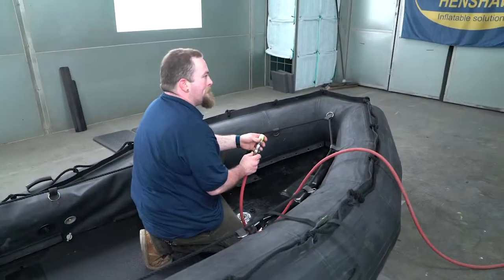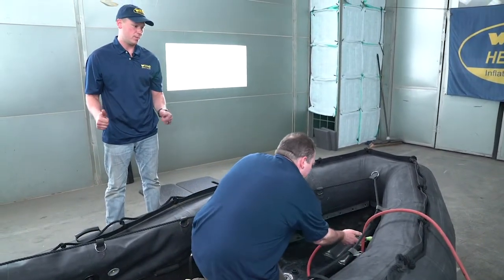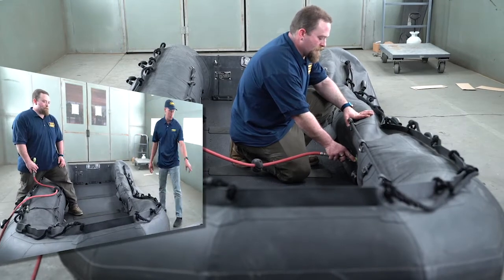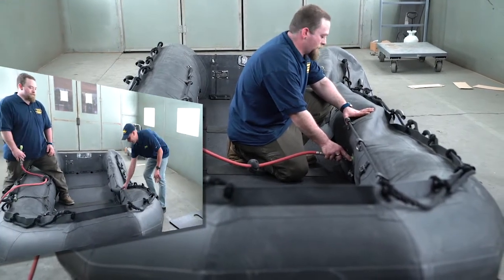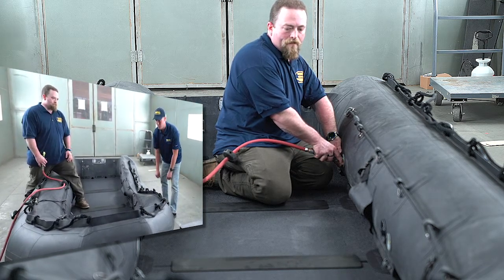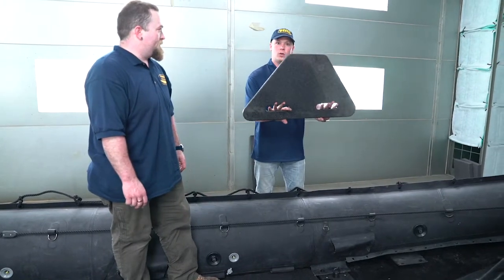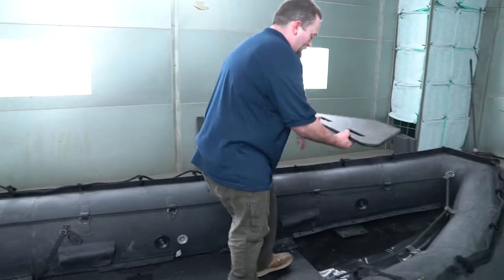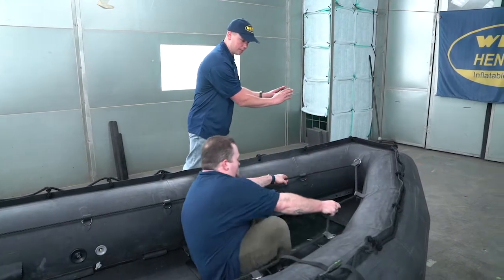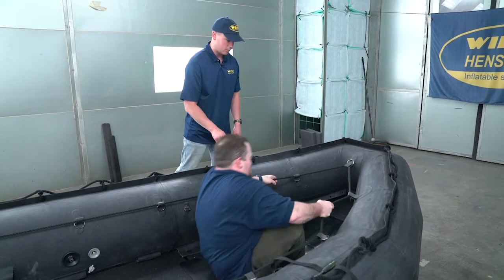Now that the thrust board aft is all installed, you need to inflate the tube 100% until the PRVs light off. The reason we air it back up for this next process is that these boards are very tight. If the tube is flat or doesn't have much air, it just folds on itself and the fabric doesn't allow you to work these boards in. By airing it up, the tube isn't folding on itself. This is the forward deck board with the hand holes — once the tube is fully inflated, grasp it, walk up to the bow, and throw it in there as hard, as even, and as far forward as you can. This makes it much easier to install the next few boards.